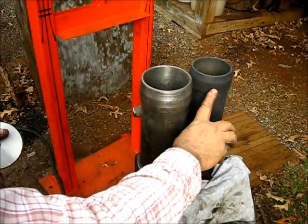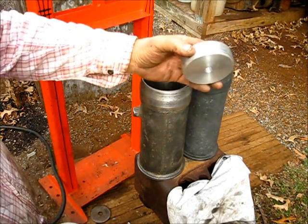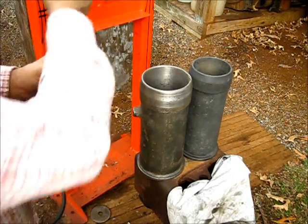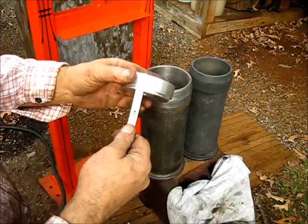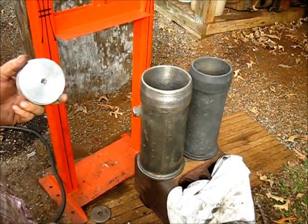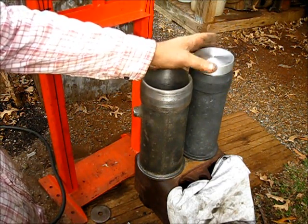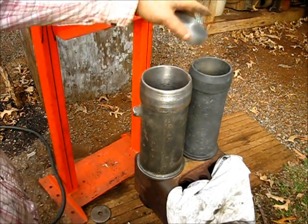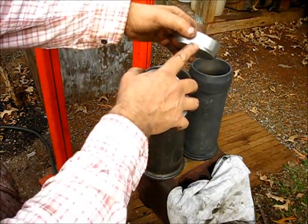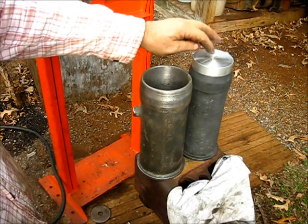This one is the igniter model. The difference in the two are quite evident. This press plate that I made is just aluminum turning — quite easy to do. I know you're going to question me about the measurements, but if you need one of these you've got the cylinder, so just make it to fit. It doesn't have to be precise, it's really forgiving, but it does need to be a loose fit because you will encounter one that's quite rusty. This one is the igniter model and you see it's a decent fit inside there — the little step holds it true.